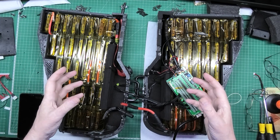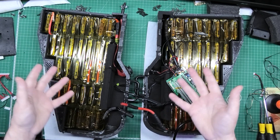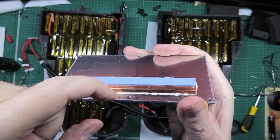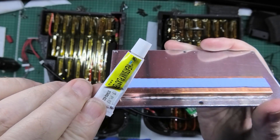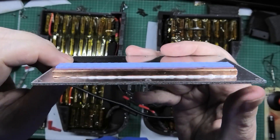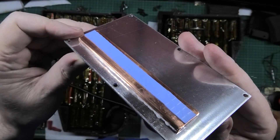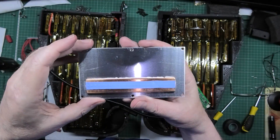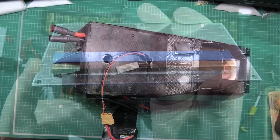I don't know how I'm going to do it - I might have to tip the battery with this side down. Anyway, I'm going to put the plate back on and then put the battery back together. I was going to show you this as well - this is my copper bus bar that I've glued onto this heat sink here with heat sink adhesive, and then I've got my thermal pad on there. That works fantastically - it keeps it a hell of a lot cooler and dissipates the heat much better. So I've got to put that on there, and then the BMS is going back in. Finished! Again!